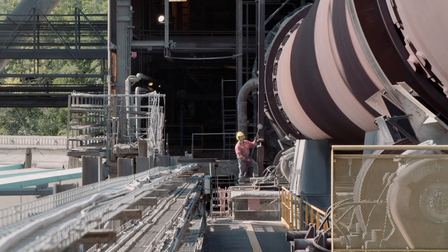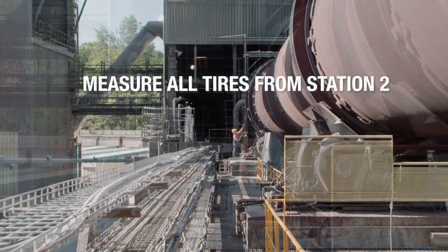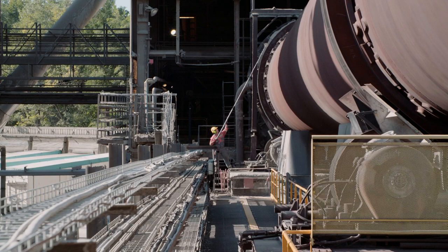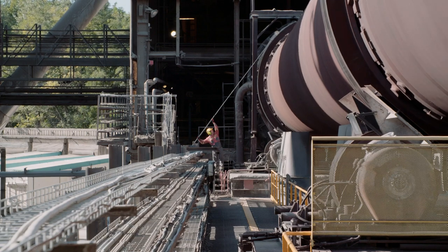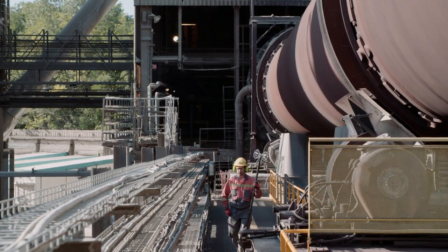The alignment check of the kiln axis is one of the most important measurements on rotary kilns or dryers with more than two piers. The straightness of the kiln axis needs to be within tight tolerances to minimize the stress in the shell and to distribute the support loads correctly among the different piers. Typical symptoms for misalignment are circumferential cracks in the shell near the middle tire.